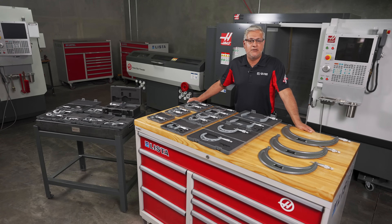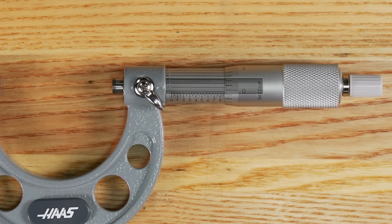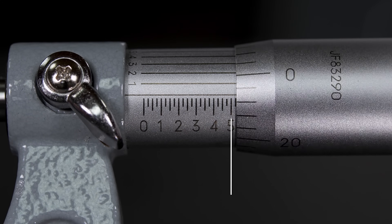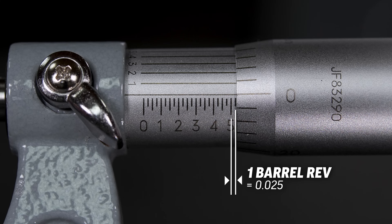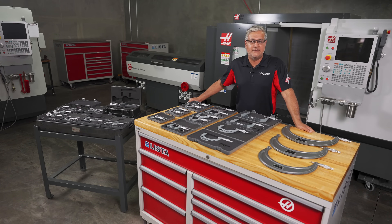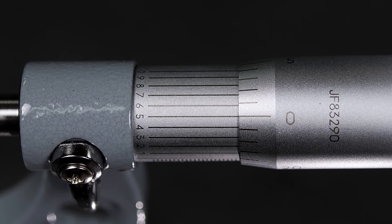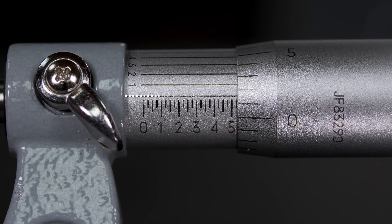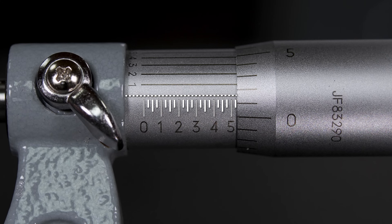The hardened stainless steel threaded rod on the inch micrometers are all precision ground to 40 threads per inch. One revolution of the thimble advances the spindle by 25 thou. The sleeve is graduated every 25 thou and the thimble is graduated by one thou. The inch mics are all one tenth micrometers, and this is why there is another scale at the one tenth graduations on the sleeve. The 25 thou graduations along the length of the sleeve are displayed along the bottom of the gauge line, with every fourth mark a little longer, denoting every 100 thou increment — 100 thou represented by one, 200 thou represented by two, and so on.